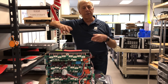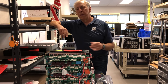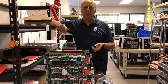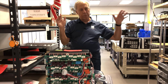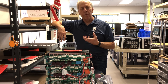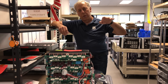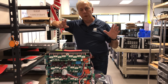They hired some pretty famous guys and built monitors that were very flat, studio quality. This was years and years ago before they really had good frequency response measuring equipment. They noticed that, to the best of their knowledge, through the crossover regions and the entire spectrum of this small monitor, it sounded a little harsh. In the vocal areas, the upper mid-range areas, there was a harshness. The only way they could get it out was to reduce — lower than flat — an area around two, three, four kilohertz.